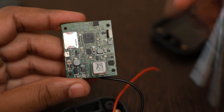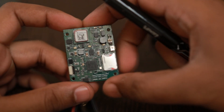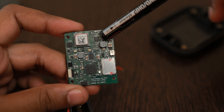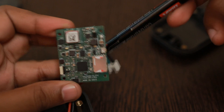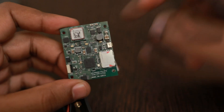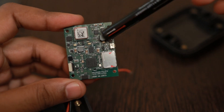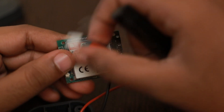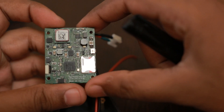To repeat the main highlights: the higher input voltage range up to 42 volts, backup battery operation using the battery connector and MP2617, RGB LED indicators, Bluetooth 5, and a 4G module with global connectivity support. Those are the major highlights of the design.